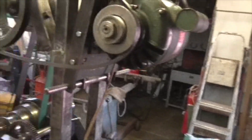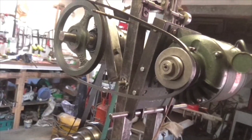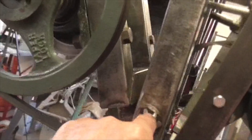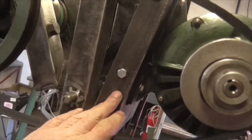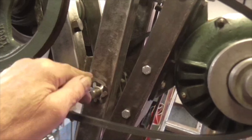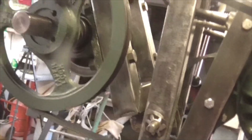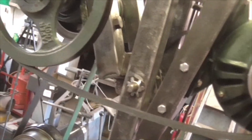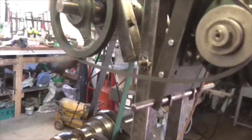For now I've got two belts which are a 53 and a 54 inch, which will do the job subject to jockey pulleys. But I've got a problem with this pin. So I'm going to strip this down, drop the motor back, take this pin out and sort out what's wrong - take that slack out that I'm sure wasn't there before. I think it's all down to the fact that I've put the wrong pin back in.